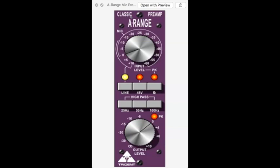For the 80B, we're exceeding our targets. We buy them at 1,000 a clip, and we go through them fairly fast. They just seem popular. In the early days, on the 80Bs we went away from the TL072 and went to OPA2134s, which during COVID and the supply chain issues went to like $7-8 apiece. The cost to build an 80B was so expensive that we decided to switch back to the TL072s, the original chips.